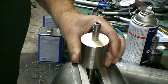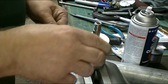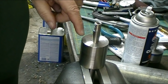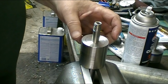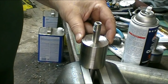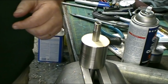When I rebuilt my Wilton vise, I put aluminum jaws in it. It was perfect for this. I can tighten it right up. If you watched the earlier videos, when I machined this, I have about a 20/1000 recess. So it's just the outside edge, about 1/4, 5/16 of an inch, that's actually going to make contact with the stone. I'll put my fiber disc on there.